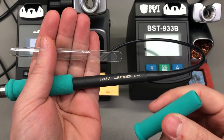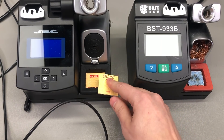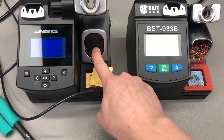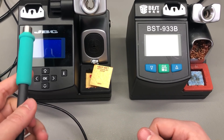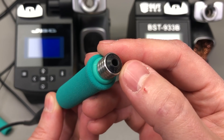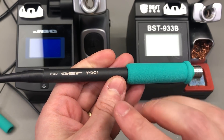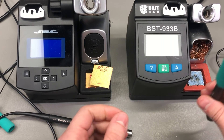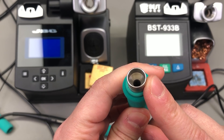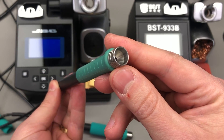When you get the genuine JBC unit, you get a couple of soft foam pads for the soldering iron, two wet sponges, the extra wire holder, the brass sponge, and a mains IEC cable. If we look closely at the soldering iron handle, we notice it has a plug where the tip inserts to prevent soldering fumes from entering the handle and causing oxidation in the contacts inside. That's a very nice touch — I don't have that on my other original JBC handle, maybe it's a newer revision, and you certainly don't get that on the best branded soldering iron.